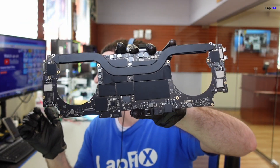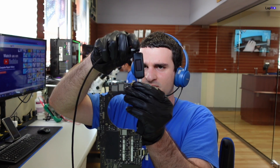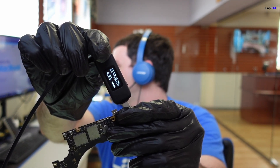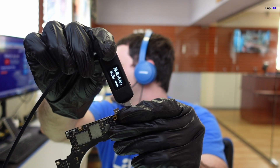I took this out — it does look very clean. I didn't notice anything particular there. There's the board, there's the back of it. Before we go into the microscope, let's take a look. Let's get one of our connectors out and just see if the behavior has changed at all, because we disconnect absolutely everything from it, especially the battery. So we've got just above 5 volts, then it goes back to 20. It climbs back up and then goes back down. Now we're stuck at about 0.01 amps.